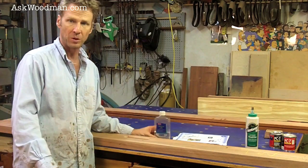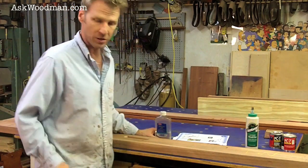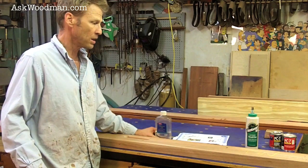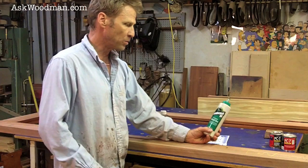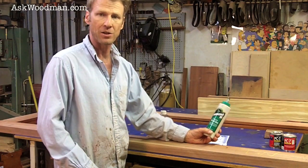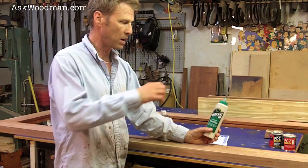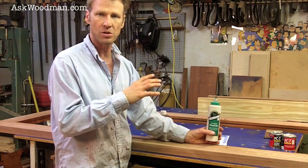Mineral oil is completely compatible with this oil-based Waterlox finish, so if a little bit gets on I can just wipe it off and it doesn't seem to affect it at all. Now I love Titebond 3 and Titebond 2 a lot, but the problem with these for me gluing up doors is that they set up so fast that a lot of times I don't have the open time that I want to really get my adjustments and squareness just the way I like it.